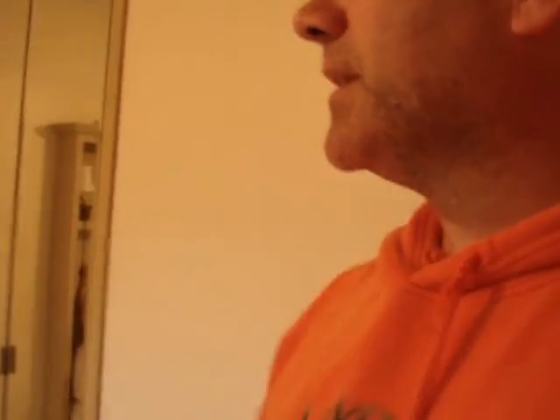I've reinstalled the fan, put the cover plate on, and turned the power back on. The first switch controls the light — makes sense as you walk into the room. The other switch controls the fan. We've got the fan and the light on their separate switches. This happens to be a remote control fan with variable speed, so I've also got a remote for that. Hopefully that was helpful. The same rules apply for running cable or phone lines. Total cost was about six and a half dollars, and even buying the 14-gauge wire, the whole project would be under $10.